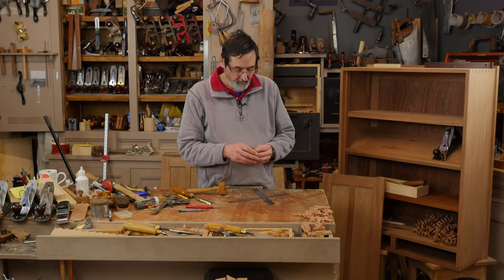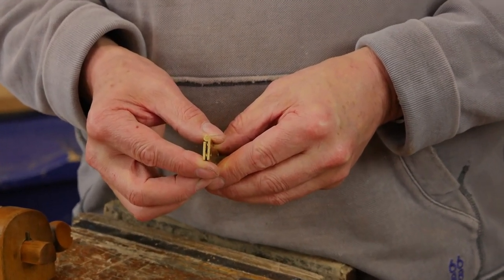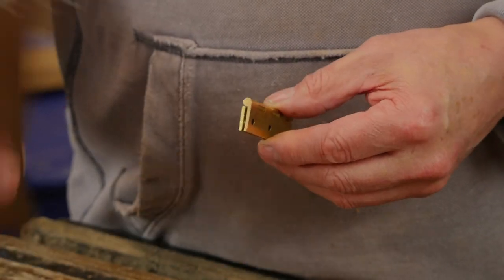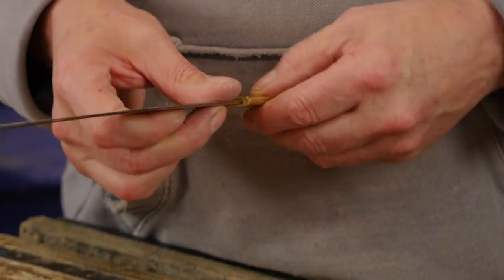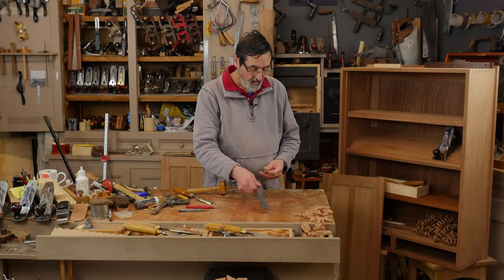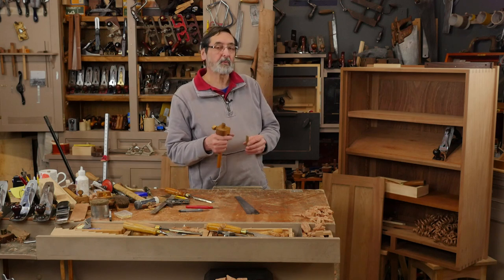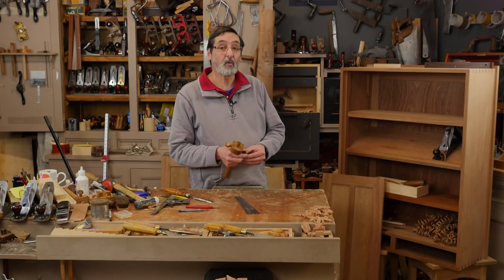When the door is closed, the gap is way too much. There's my half mil and I still have a good millimeter of steel to put in there — that's almost one and a half mil — and that's too much for the gap on the stile of the door. So in this case I'm going to reset the depth of my gauge to compensate for the extra gap between the hinge plates when they come together. That's very important when you're hanging the door.